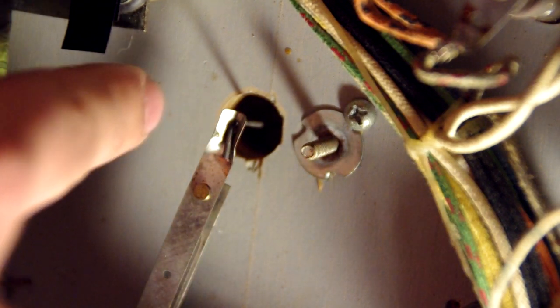This is the underside of the spinner mechanism and it's actually a lot simpler than you might think. It's just a long leaf switch that at the very end has the contacts. It's connected through the playfield to one side of the spinner and the cyclical motion of the spinner causes the switch to frequently open and close. When the spinner is at the top of its position the switch is closed, but in its resting state the switch is open. So when it gets spun really fast by the ball it opens and closes the leaf switch quickly, which gives the scoring effect. It's quite a simple mechanism for the effect it produces, and spinners were generally quite popular.